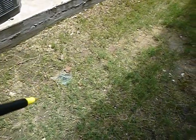These are not surface drains. These are discharge ports for the rain gutter downspouts. They discharge underneath the ground, and this is where the water exits. So those drains do not accept water, they expel water.